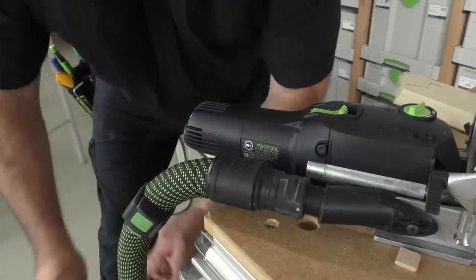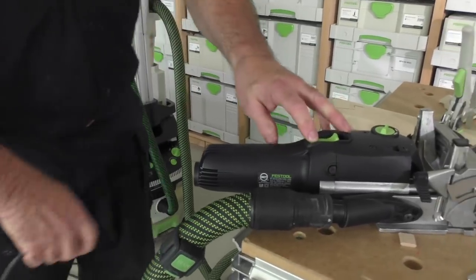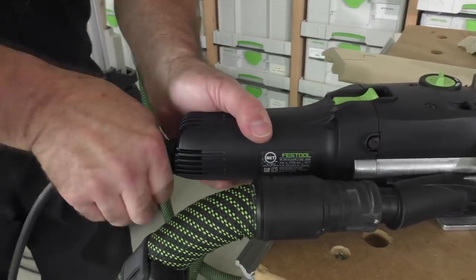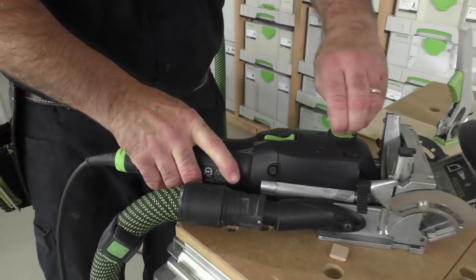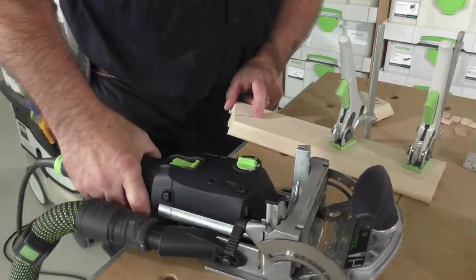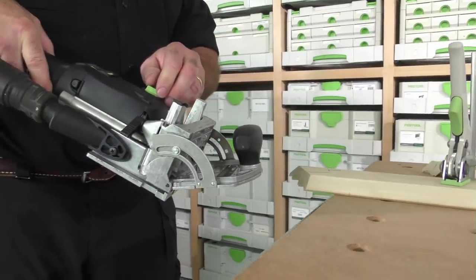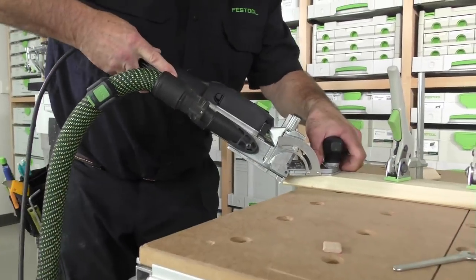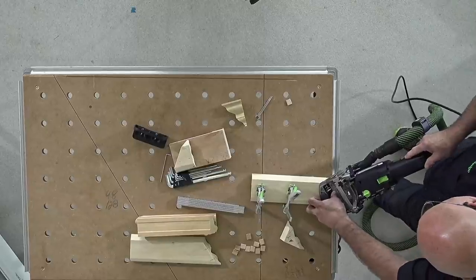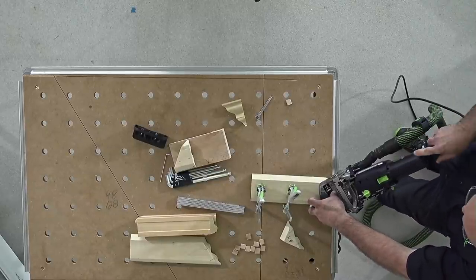I think I've said this a hundred times on Festool Live: before you put the cord in, make sure your machine is off. When you switch between settings, make sure. And I'm going to take this and make that mortise just like this — making sure that plate lies dead flat.